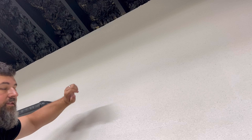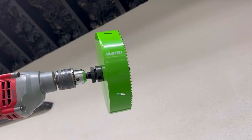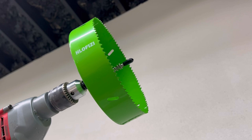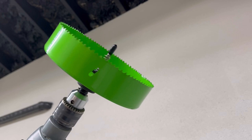Take the distance between those two pin marks and divide by two. In this case it's a 24-inch span, and the center of that is where you're going to put your center bit on your hole saw. This is a seven-inch hole saw — yes, the thimble is seven inches in diameter. I got this off Amazon and it was probably one third the cost of the ones at Home Depot. The Home Depot ones are Milwaukee and Diablo, so they're better quality, but this is a one-time use for me.